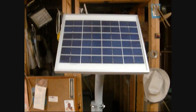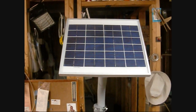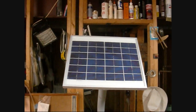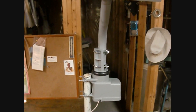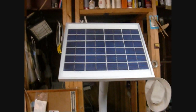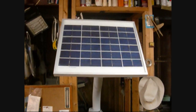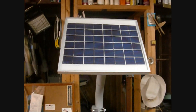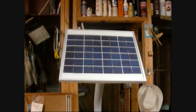It's very easy to adjust the tilt, so I don't really have to worry about having that second axis, which really only adds about 6% more to the overall power production if you do it perfectly. So single axis is a big step that you have to conquer. I have the circuitry basically done. I'm not going to show it to you because I'm probably going to build these in some kind of production fashion, but I at least want to give you a little demo of how it works.